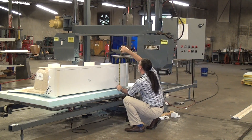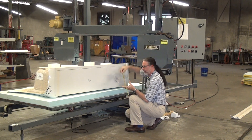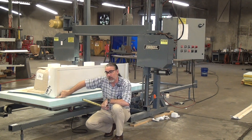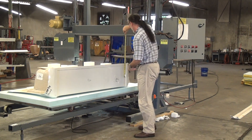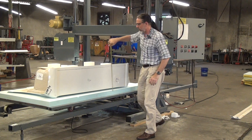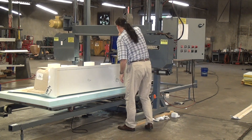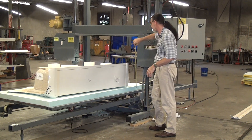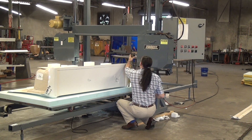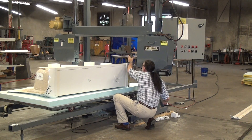Height to that line — they marked 14 and 3 quarters on here. I think what they did is they measured from this edge here up. I have the workpiece sitting here and I believe this is about an inch taller, so I'm measuring that the line is 15 and 3 quarter inches. That's where I'll set my blade. Again, in production you'll have an electronic digital readout to make it easy to do this. Overshot — let's do it again.